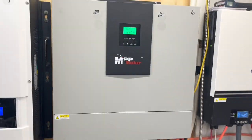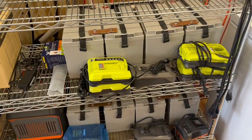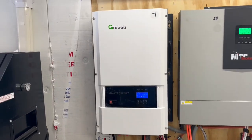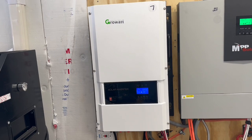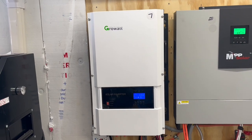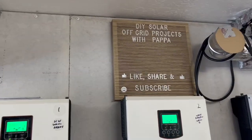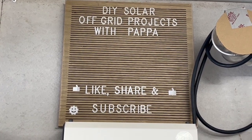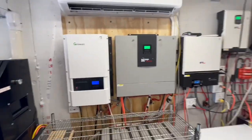What we'll probably do is take the battery bank down there, disconnect it from this one, and connect those two so that we have two 48 volt battery banks going into this 12 kilowatt low frequency off-grid inverter. We should have enough there to be able to start both air conditioners at the same time, so we'll work on doing that over the next couple of days. That's pretty much it — please like, share, subscribe, and hit that notification bell. We hope you have a truly wonderful and very blessed day. See you soon!